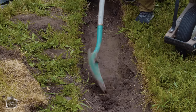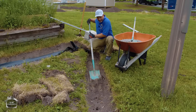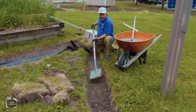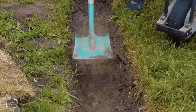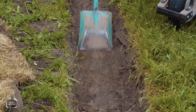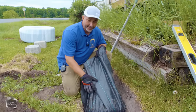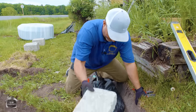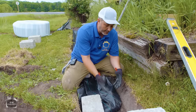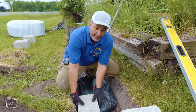If I'm digging making a big mess with a shovel, I've got a bunch of disturbed soil left. But if I take the flat-bottom shovel and simply carve out my edge, I've got a nice flat surface for my geotextile and stone to sit on — that makes it a lot easier to set my wall. When you're digging your ditch, you have to have a space wide enough for your retaining wall and the weeping tile, which is a four-inch round plastic pipe with a sock on it. Going 12 to 16 inches wide should be fine.